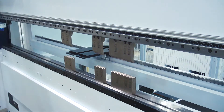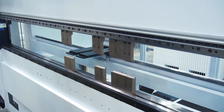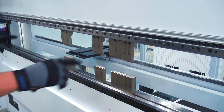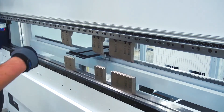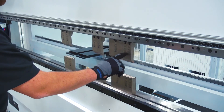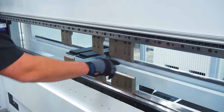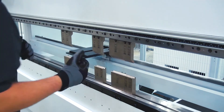We've got all our bending tools nicely locked inside the machine. Now I can use the operator pedal to start the hydraulics on the press brake. I'll go over to the machine control, switch from the tool setup screen to my automatic run screen and hit cycle start. The other step is to set the safety system — the send and receive units at each end of the machine — to the height of the tool. With Trumpf tooling, the working height is printed right on the front of the tool. In this case I had the safety system preset to 120 millimeter tools, so I'm ready to start bending now.